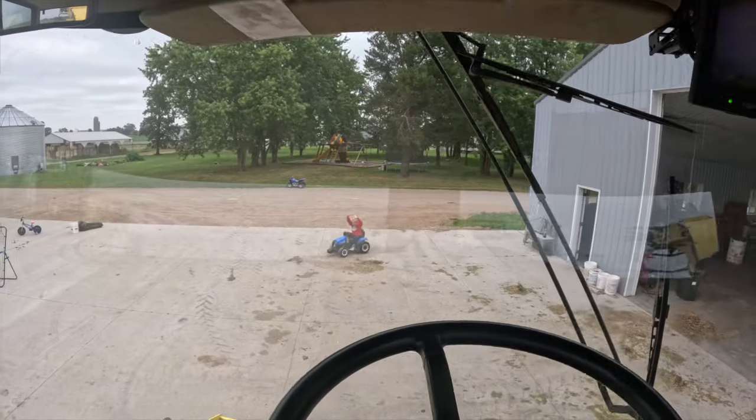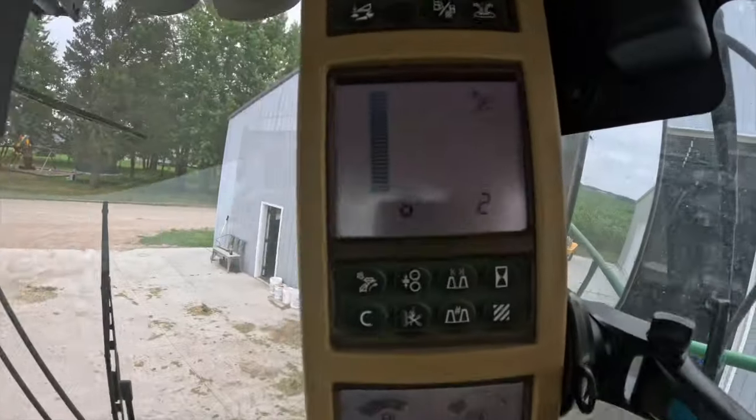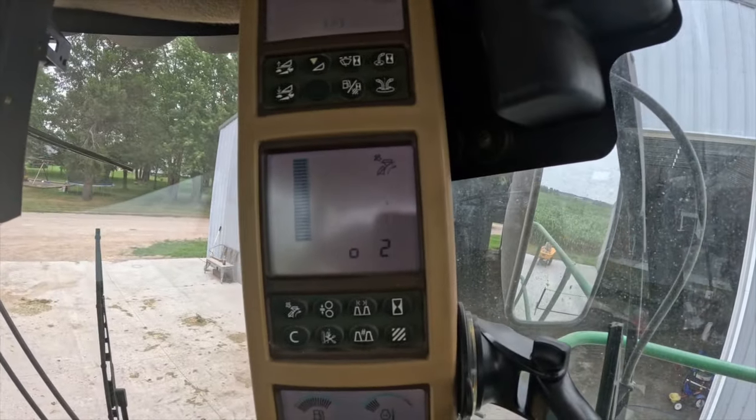It's about 0.75 in metric but it doesn't go right to 0.7 — it kind of jumps around a little bit. Haylage is a little bit shorter cut. We're gonna run probably three knife sharpenings because the blades are pretty dull. With our hay, most of ours is in sand grounds so we get a lot of sand in our hay and that really dulls the knives up. We're just about done — we're at two passes left.